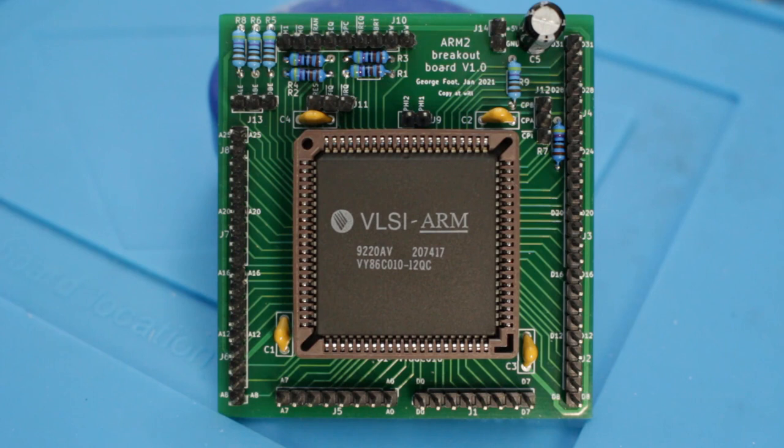The way the ARM actually accesses the data bus - it is a 32-bit bus cycle, so its default mode of operation is to pull 32 bits of data at a time from memory and write 32 bits back to memory. These memory accesses have to be word-aligned as well, so the address bus almost always has a multiple of four on it, except in the very rare occasions that it is addressing a single byte of memory.